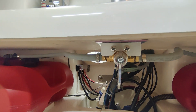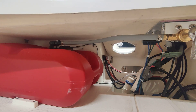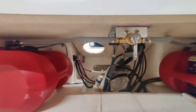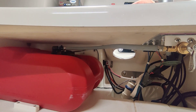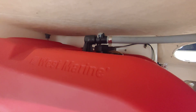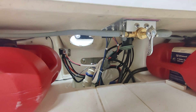And back to off if you wanted to. The reason I did this is because I didn't want to be moving fuel lines from tank to tank out in the water, and the possibility of damaging an o-ring on one of the attach points. That just seems a lot easier — to be able to reach down and select the tank.